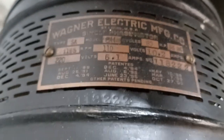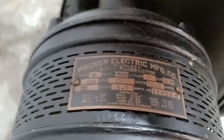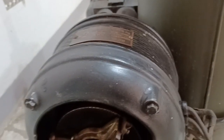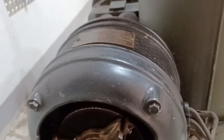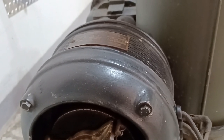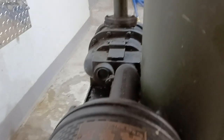These ArcoWand units, to my knowledge, all used a special 1165 RPM motor. Your regular standard induction motor is 1725 RPM, and your turbine machines like the Tuek and the Spencer used 3600 RPM motors — or 3450 is what they're actually rated for — for higher speed. But these used a slow-speed motor because these pumps ran that slow. They were direct connected.